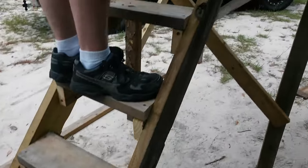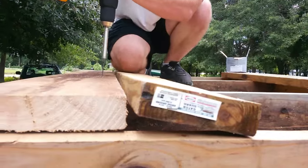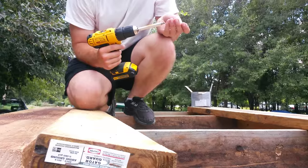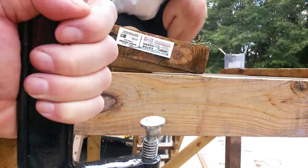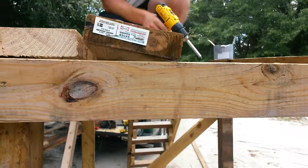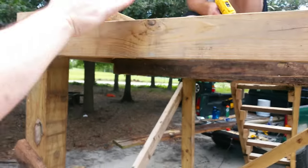Steps are done. These off the scrap piles — see how warped they can be. I'm going to get Thomas to fasten this twisted 2x6 down at the other side, and then I'm going to take my big C-clamp and put it on this bad boy and pull it down straight and let him bolt it down. You already got the other side fastened?